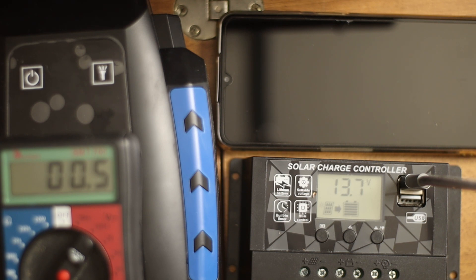So there you are — this is half a milliampere. I can see that in some way the commenter is right, but I think that half a milliampere on such a battery will be a leakage current of the MOSFET. I think it's not important — half a milliampere on a battery of 100 ampere-hours, that's really a long, long time. I would not worry about it.